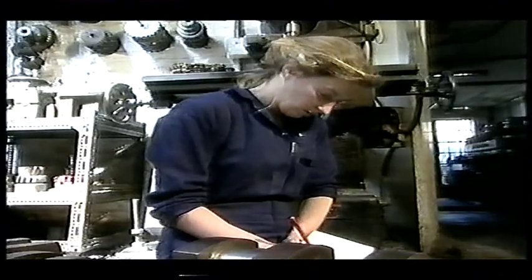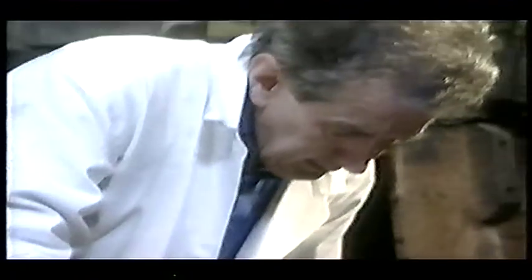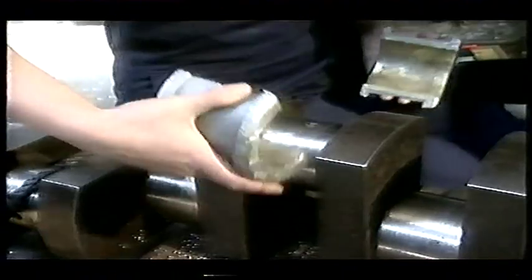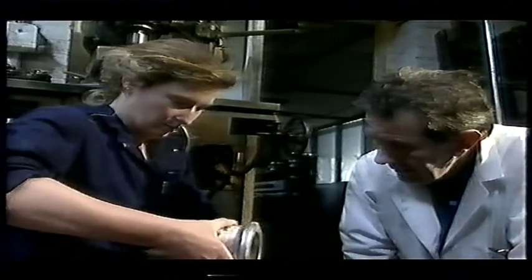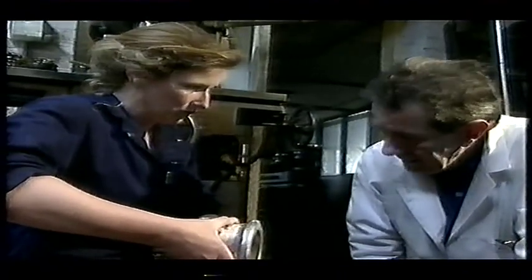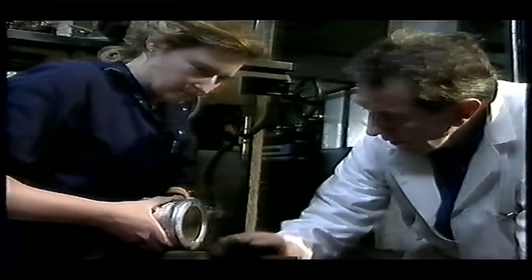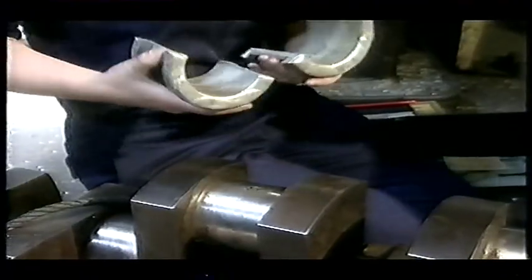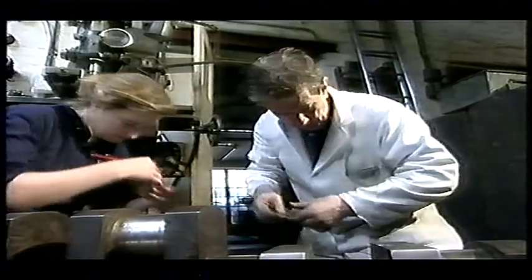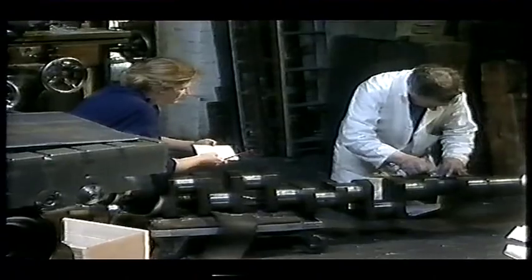The tailor of metal who's going to make those bearings fit is engineer Colin Dinsdale. Hopefully what we'll end up with is a really nice good fit between the bearings and the crankshaft, with minimal clearance just to take a bit of oil, but the white metal will take the thrust. As the crank was so old and worn, we had to measure each bearing individually before machining them to fit.